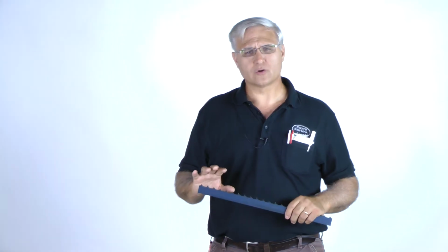Now people do it, and I'm not saying you can't, but the smaller the wheel is and the thicker the blade, the shorter the life of the blade normally. If you're wanting to cut production and need it really straight and want to feel confident, you may sacrifice the blade. It's all about that point of diminishing return. The thicker the blade, the larger the diameter wheels.